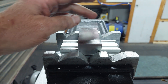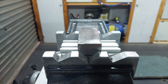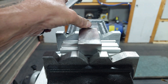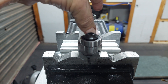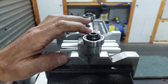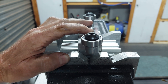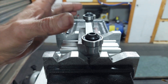Because of my blunder earlier on — cutting this recess too deep for the dovetail — the meat that I've got here is a little bit thin. So what I've decided to do, instead of cutting it to full depth, I'm only going to make a register for the tool to sit in and then drill two holes through the tool and into the body of the tool holder to keep it in place. The recess will just keep it from rocking and the bolts will keep it seated and permanently mounted. This is a dedicated tool holder, so I'm not going to use it for anything else.